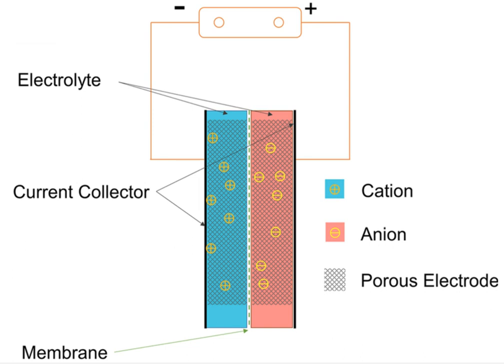Light rails and trams. Supercapacitors make it possible not only to reduce energy but to replace overhead lines in historical city areas, so preserving the city's architectural heritage. This approach may allow many new LRV city lines to replace overhead wires that are too expensive to fully route. In 2003, Mannheim adopted a prototype light rail vehicle (LRV) using the MITRAC Energy Saver system from Bombardier Transportation to store mechanical braking energy with a roof-mounted supercapacitor unit.